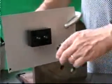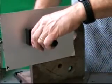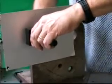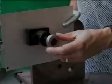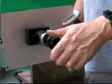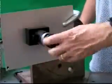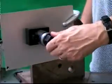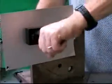And then we take our DD puller and present it with the proper bolt spacing to our bolts here that are going through the base of the die. And we simply add our thrust bearing and our drive nut. And we want to make sure we always observe good safety practices, have a clean, uncluttered work area, and always wear safety glasses.